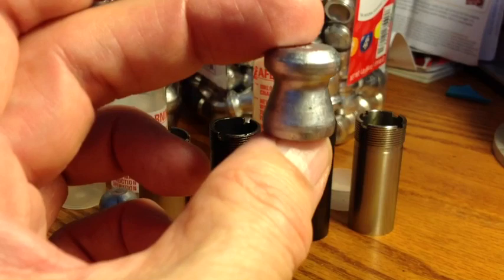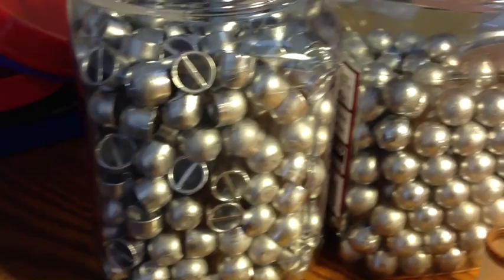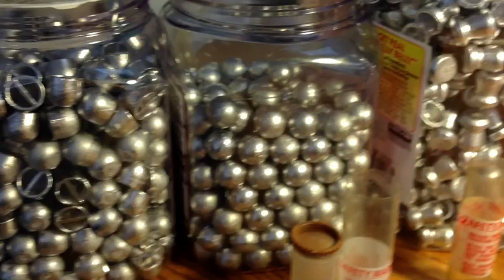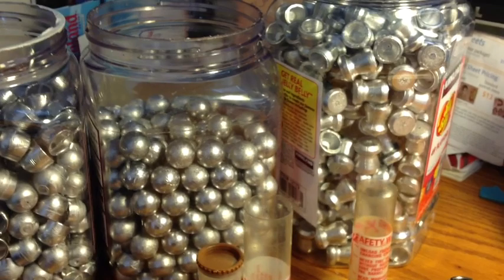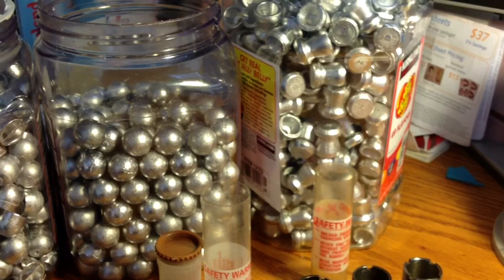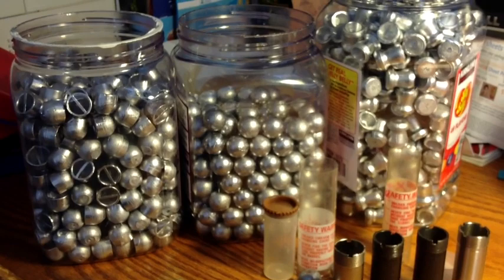YouTubers, the best policy for slugs is to make them out of pure lead or dental x-ray lead, which is like 99% pure lead — which is plenty pure. Good luck out there. If you can't get pure lead and there's no other choice, you do have Roto-Metals, which has pure lead for sale. Or, as they used to do back in the early days of this country, is to dig the bullets out of the trees, out of the tree stumps, and reuse the lead. Bye for now.